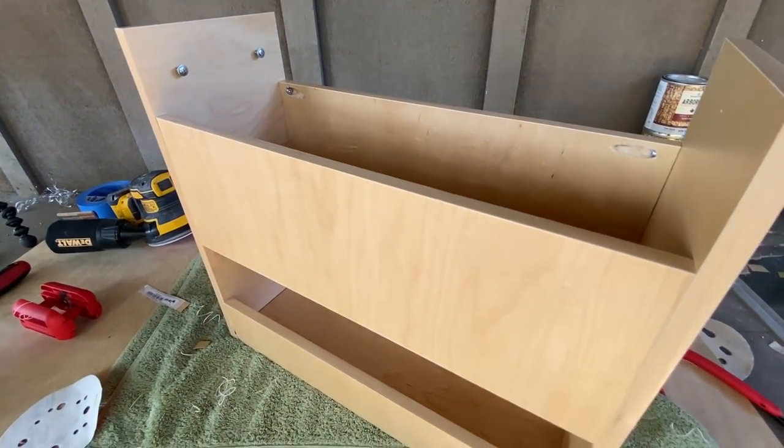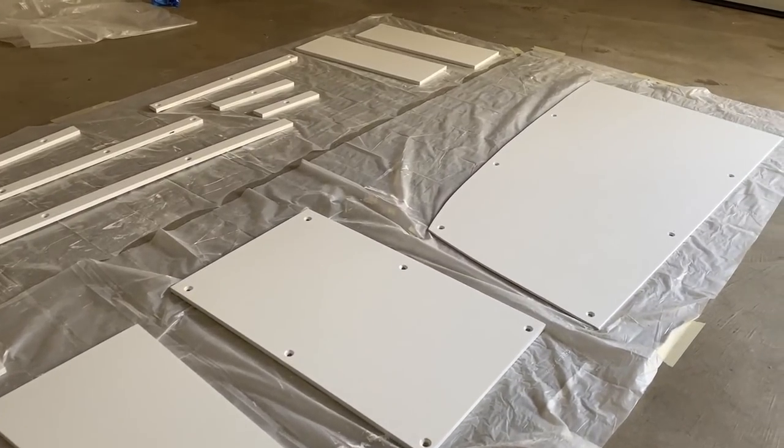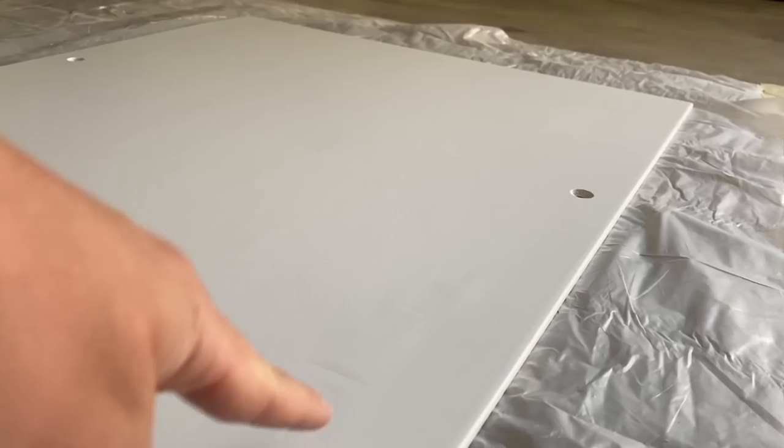This is what it looks like when it's totally finished with edge banding. I showed this to my brother and asked if he'd have ever noticed it was edge banding — he didn't. Our final coat of paint has finally dried and the panels are 100% complete. Overall they look pretty good but there are a couple of small issues. This comes down to a trade-off of using the lighter-weight five-ply maple versus MDF or nine-ply Baltic birch — both heavier options are a lot flatter, giving you way fewer painting imperfections, while the five-ply is lighter but has natural imperfections.